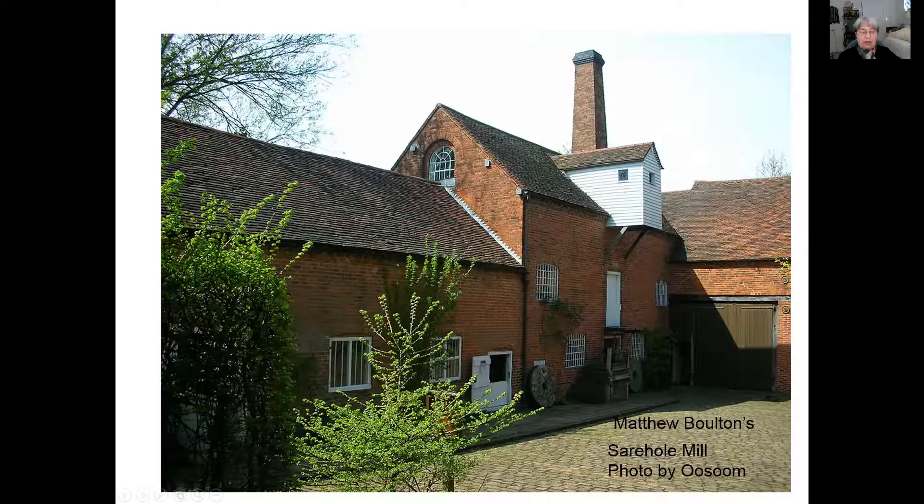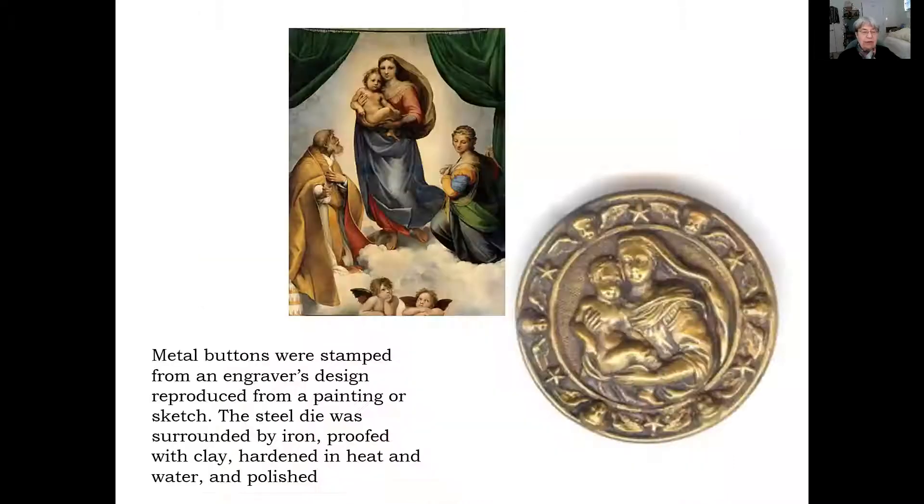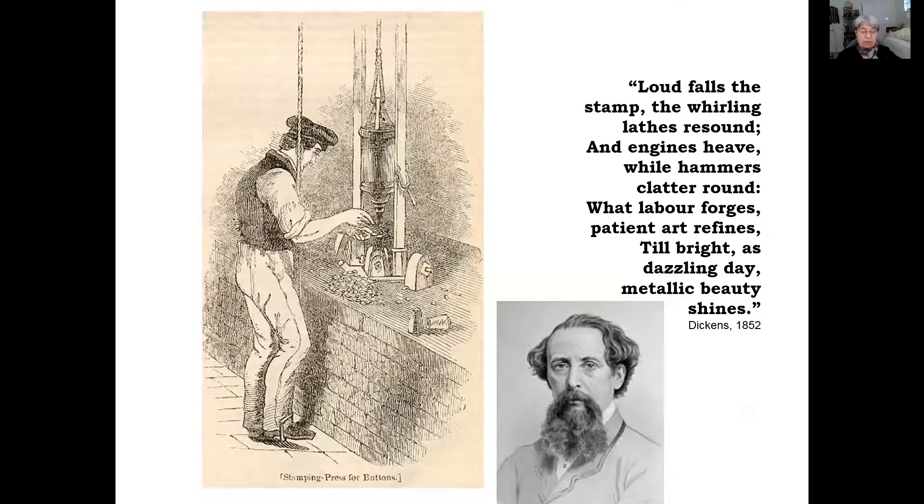Here's how that worked to transform sheets of metal — copper, white metal, gold metal — into coins and then into buttons. First, you had to have an artist take a design and engrave it onto a steel die. You would take a painting or a sketch, carve it into iron, test what it looked like with clay, surround it with an iron band, and put it in a kiln to harden it. They would then cut sheets of tin, aluminum, brass, or copper into circles. A guillotine-like weighted machine stamps that pattern into the metal circle to make a coin, a button, or a buckle.